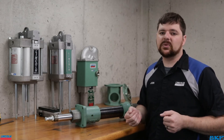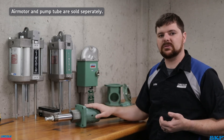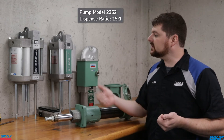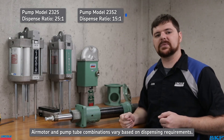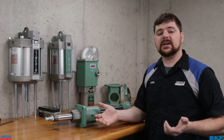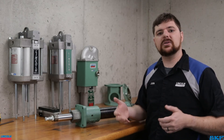If you have identified the air motor as well — say this 84800 was installed onto this pump tube — this would create the model 2352 pump assembly. Attaching this 8-inch 84808 air motor to the 84900 pump tube would create the model 2325 pump assembly. Having successfully identified this unit, we can now obtain the parts breakdowns and kits in order to repair the unit or find specifications needed to map out a new dispensing system.